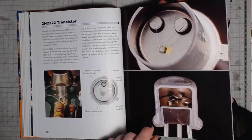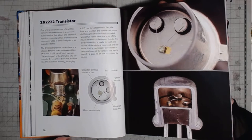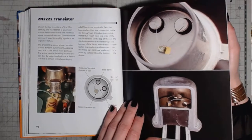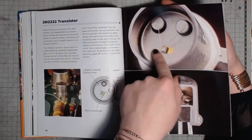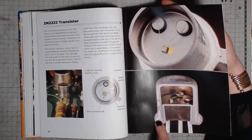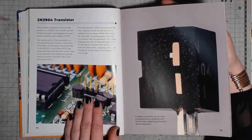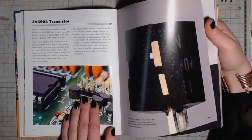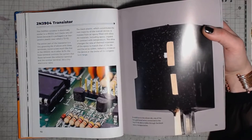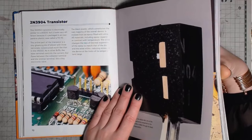The old transistors with TO18 enclosure, once they were pretty common, now you mostly find the TO92, which we will move on to pretty soon. This allows for some good cooling, because the structure has a good thermal contact with the base and the cap. The TO92 transistor. It's pretty filled. The epoxy also provides some thermal mass, sucking away the heat that is dissipated when the transistor is working.